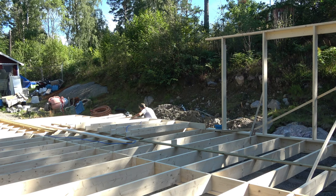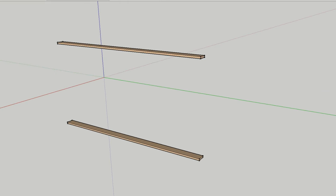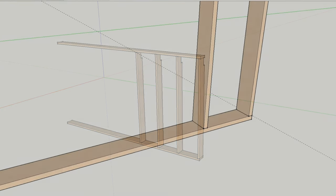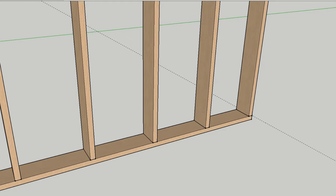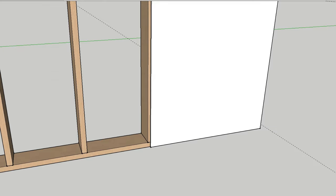For those who are new, you can think like this: let's say you are going to build a 10-meter long exterior wall. You can lay out your studs CC 60 centimeters or CC 16 inches directly by measuring from back edge to back edge. But if you are going to have a plasterboard or other board on the wall, the first stud must be moved half the width of the stud. After that you can measure your CC measurement for the rest of the wall. The CC measurement is laid out on the entire wall and everything around it must adapt, such as doors and windows.